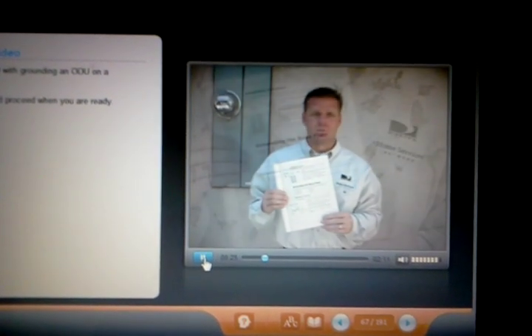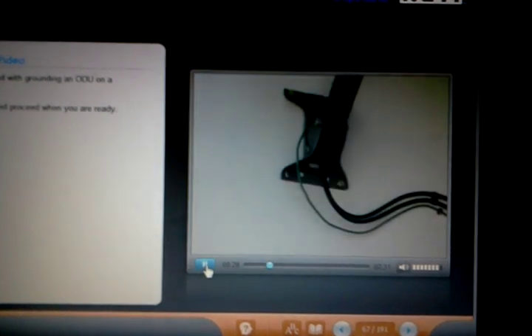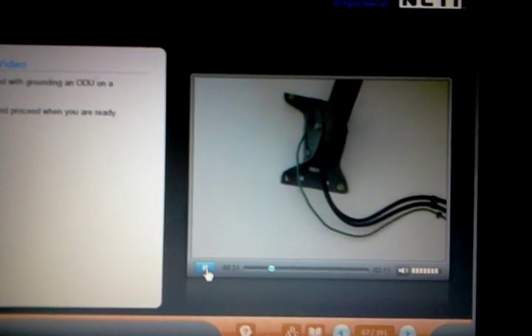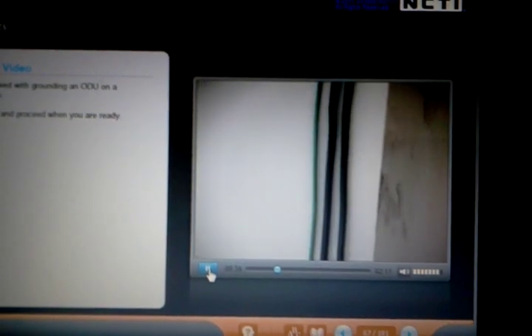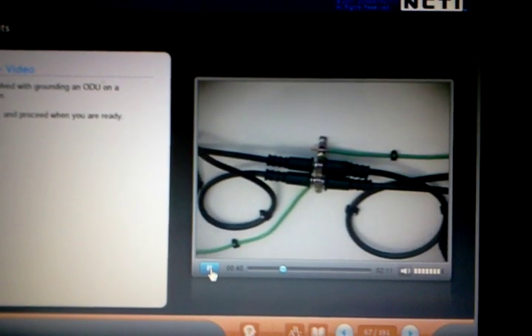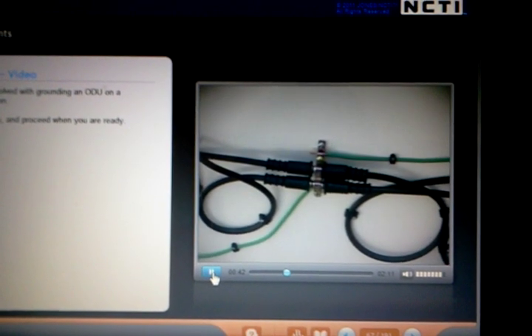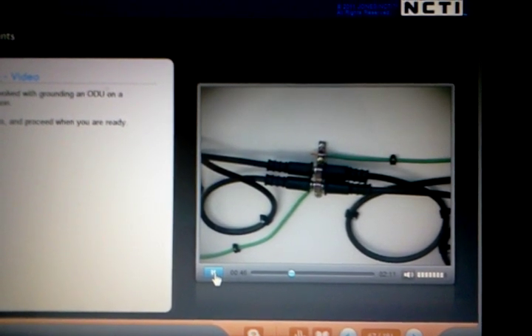Installation manuals enclosed in the systems show the antenna being grounded by a separate ground wire. When using a dedicated ground wire, route it directly to the ground block location. This ground wire should be run with as few bends as possible. If it is carrying a high voltage charge to ground, it will perform much better if there are no sharp turns or bends.